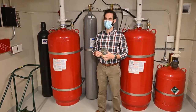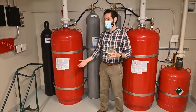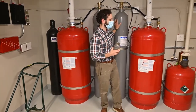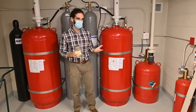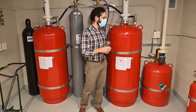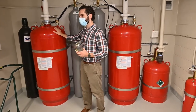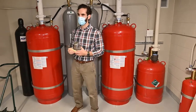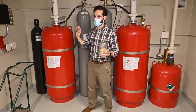So here we are in the level four tank room — this is for all the clean agent system suppression. We have the big Titan tanks here propelled by nitrogen, and then we have two Force 500 tanks propelled by nitrogen self-contained within the tanks. Those bottles are at 500 psi, these bottles are at 240 psi, and these nitrogen tanks are somewhere around 3,000 to 4,000 psi. They're totally fine — you don't have to worry about being around them, just don't play with the control heads.